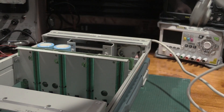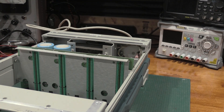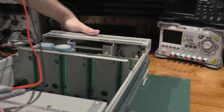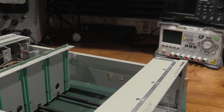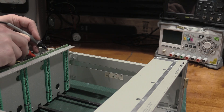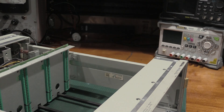Just make sure there's no smoke. All the fuses look okay — we can continuity test the fuses real quick; probably wouldn't be a bad idea given what we found in it. I did have a chance to speak with the owner of this powerframe and he informed me that it was not powered on, so it looks like we caught something that would have otherwise been not so good. All the fuses buzz out okay, so we are good there.